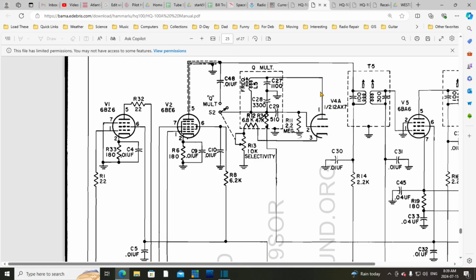It's a positive feedback arrangement, which means eventually it's unstable. If you send too much back, you'll just get feedback occurring. In this radio, if you turn this adjustment to the point where there's too much feedback, then the radio goes silent. And no doubt it has to do with what's happening in this circuit here.